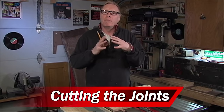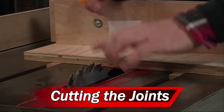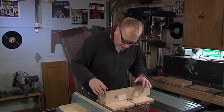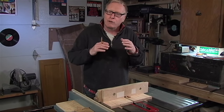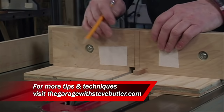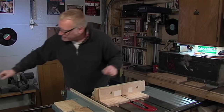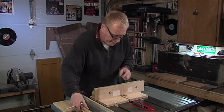The key to the toolbox is the box and finger joints. I've attached my stacked dado blades, taken out the old blade. I have a box joint jig that I made here — pretty simple. This one looks a little elaborate — I can adjust and fine tune it. Just take your time setting up and you'll get great accurate joints every time. I have half-inch blades in here. We made one cut with the dado blade, moved it over, made a second cut, and attached an indexing pin. Let me show you how this works.